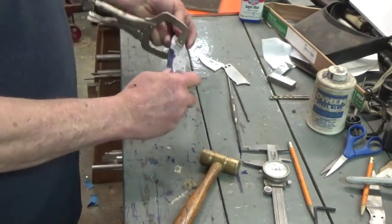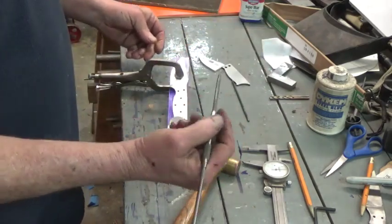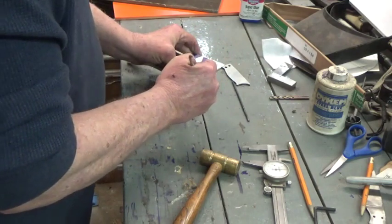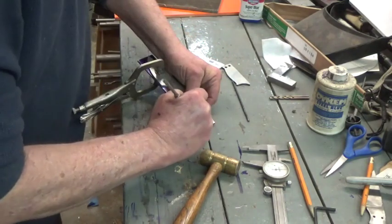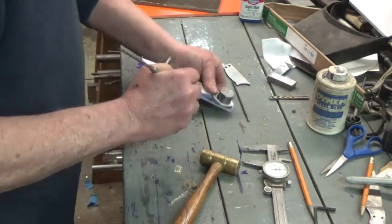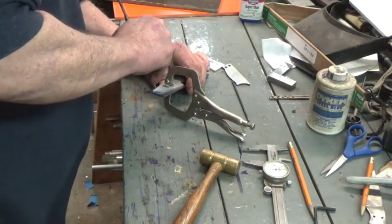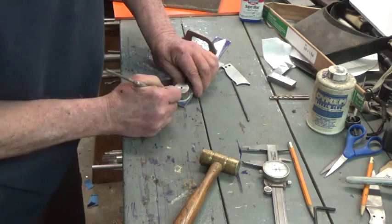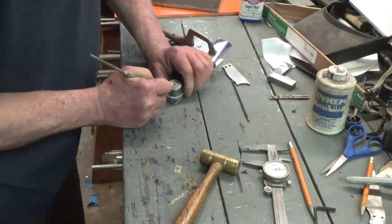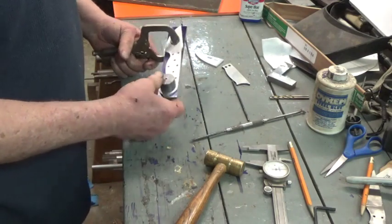I deburred the hole and pushed the little guide down through. The pattern clamp is back on and now I'm going to take a scribe and make a pretty deep scratch all the way around this perimeter so I can profile this. I work my way all the way around, then transfer the holes over at my bench. We'll be drilling and cutting our profile out. Go over the touchy areas a couple of times to make sure you get a good deep scribe, because as you're profiling on the grinder it heats up and the dykem turns brown and disappears. You flat-sand to clean that off and still see your scribe.